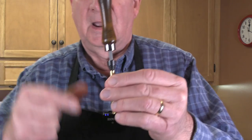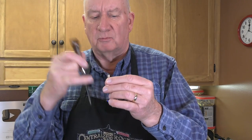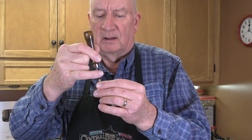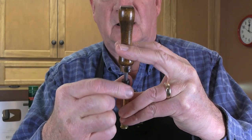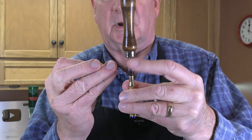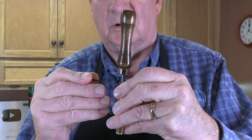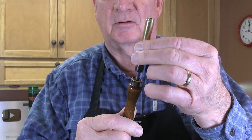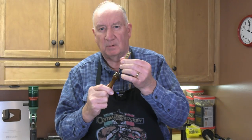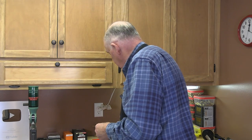After you trim it, make sure you slightly chamfer the inside — but don't make a sharp bevel. The point is simply to remove the burr. Insert that tool down inside, and when it's all the way down, tighten that collar. I don't have my glasses on, so I'm just doing it by feel. I just turned that and I could feel a small burr scrub away. That's what I'm going to do now with each of the cases. But first, we've got to make sure that each of the cases is exactly the same length — 2.530 in this particular case.